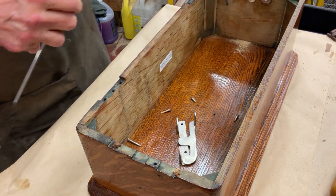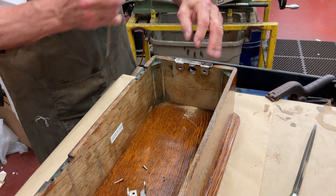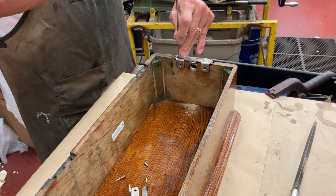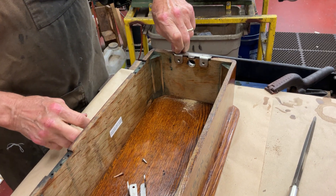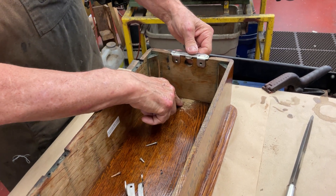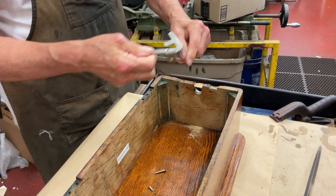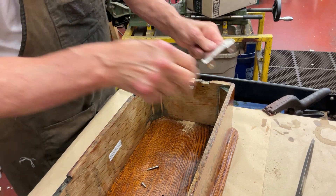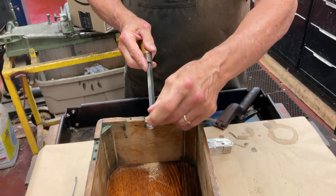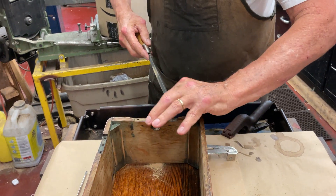So what you do is when you install it — you take it apart. You can see a little bit of my dust. You file this out, because these do have a little bit of movement in them, but it drags right here. So you come in with a file — I use a diamond file like that — and you just file a little.